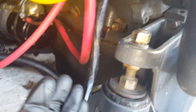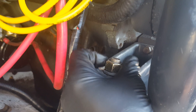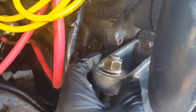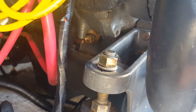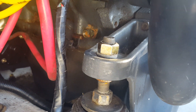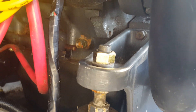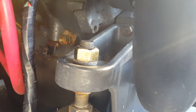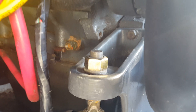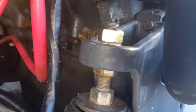Now I'm back at the engine. Before you call it good and take the alignment tool out, go in here and tighten these nuts down — make sure you don't throw off your now-perfect engine alignment. Don't call it good until everything is tightened down. I have my partner double-check after tightening and she confirmed everything was still good.